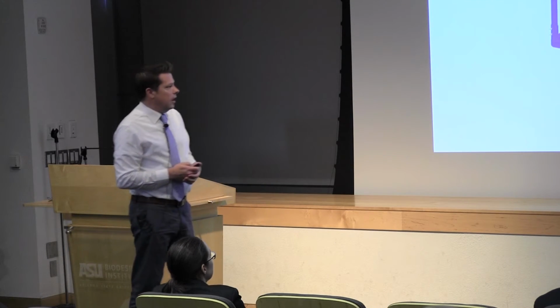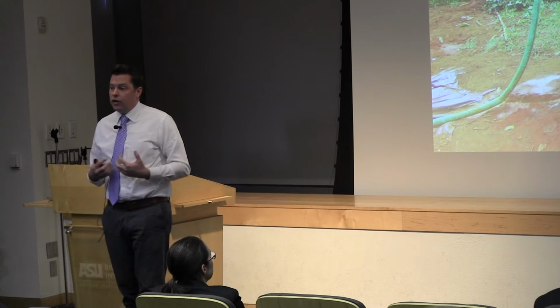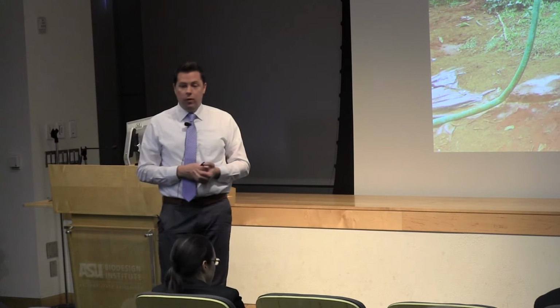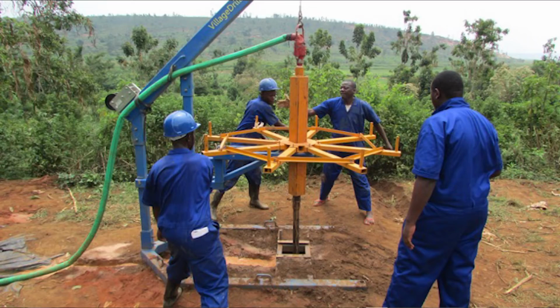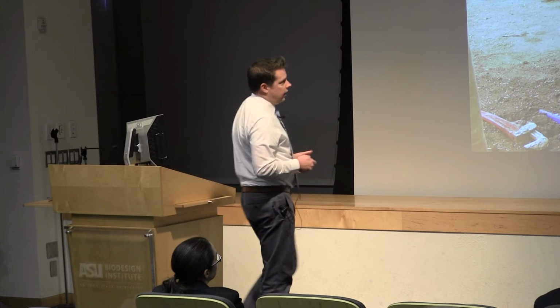All right, so that's the basic functionality of the village drill. And as simple as the machine is, I can assure you that each of its features were designed thinking about the users and thinking about the people who would need to deal with the village drill every day. So for example, this yellow wheel seems to be hovering in the air with no structure underneath it, and that was on purpose because so much work has to happen underneath that wheel. All the pipe changes are happening, and so we wanted to have nice, clean access.